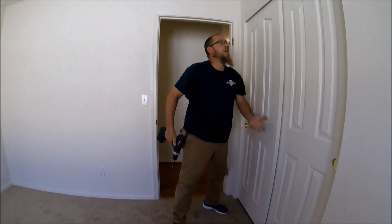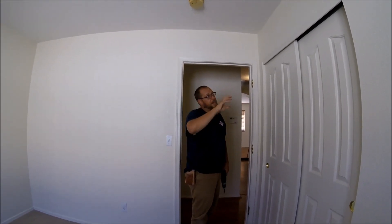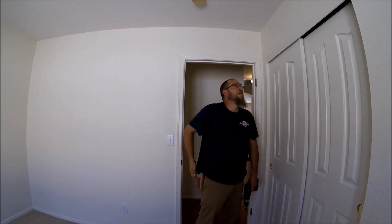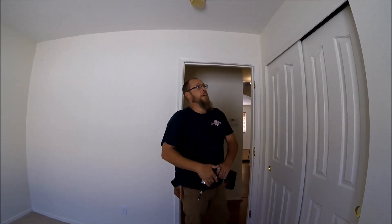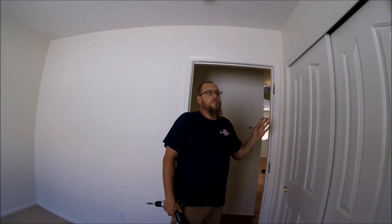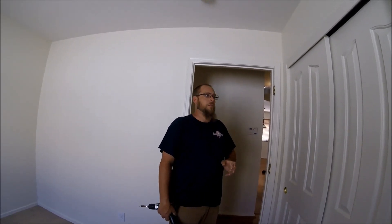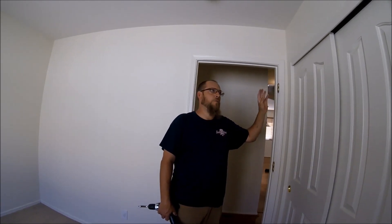That's about all there is to know about these little sliding doors. I know I see lots of damaged doors where they're stripped out and people fight with them all the time. Usually I'll just fix them for the customer while I'm there because they're so easy to deal with. The only other problem outside of what we covered would be a busted wheel, and those are very easy to replace — just unscrew the old one and screw another on in the same holes. If the holes are wallered out, scoot it over just a little bit and put it in some fresh holes. Those wheels are very easy to find at Home Depot and they're really cheap.